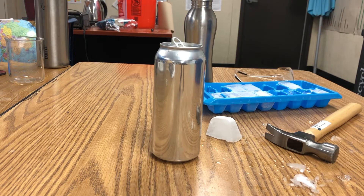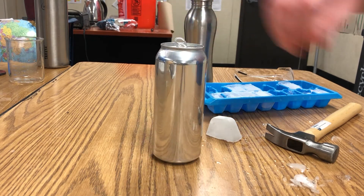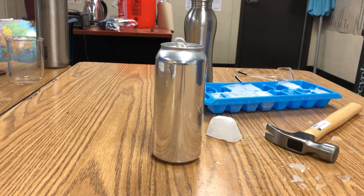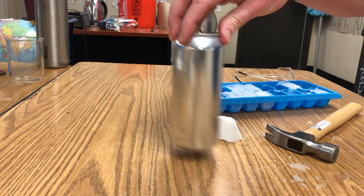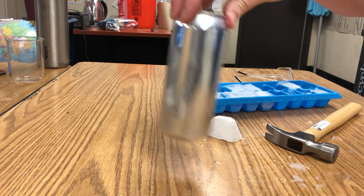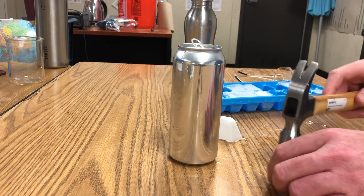You go very slowly. The idea is, it takes a little time for the dew to form. You want to basically be able to see it the moment it starts showing up. You don't want to hit the dew point and then drop 10 degrees before you see the dew starting to form on the outside. So you put it in there — it makes a funny noise, too — and you just keep getting colder. Nice and slow.